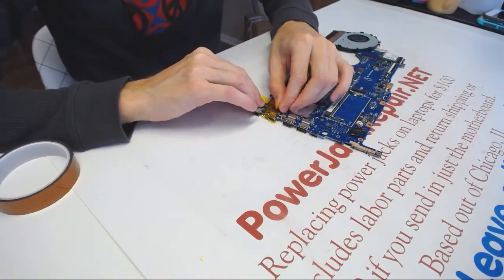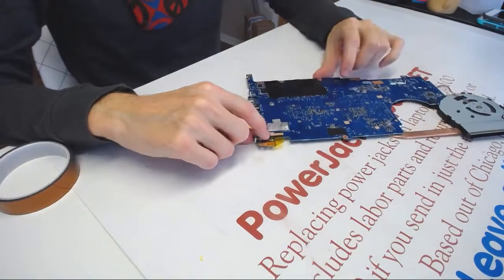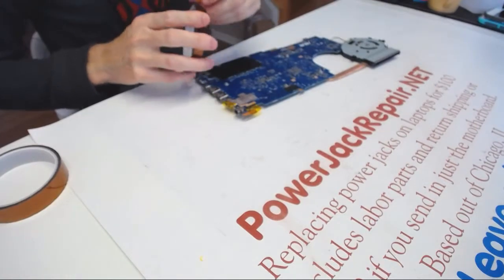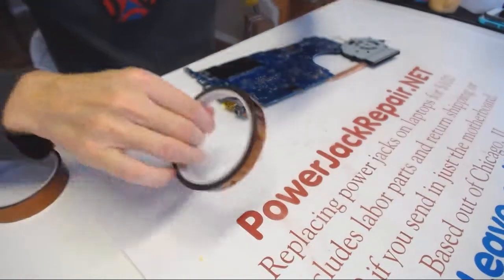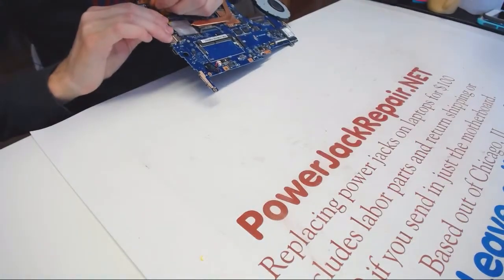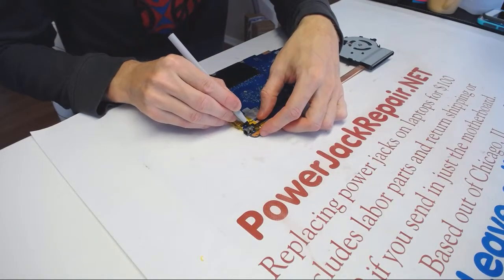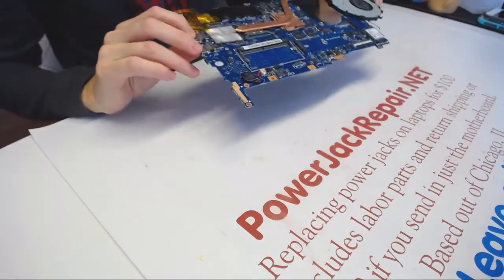So we put the Kapton Tape like that. It's very important to use the Kapton Tape on this small black component right here, because that's the component closest to the jack. If this component gets desoldered from the motherboard, then we kind of screw it — it's really hard to solder those tiny little components back. So I'm going to put a double layer of Kapton Tape here just to make sure that part won't get desoldered. Now that we've insulated everywhere around the jack, insulation is really important.